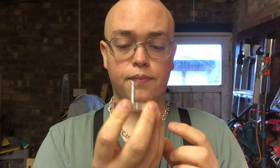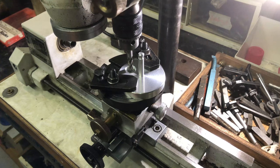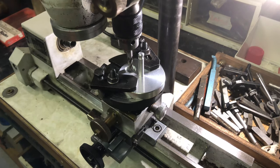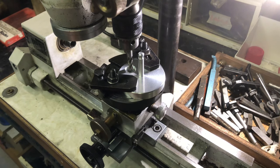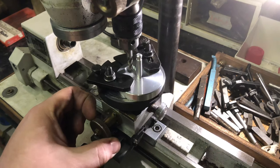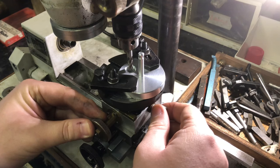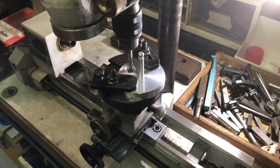So, what I'm going to do, I'm going to get the mill all set up for you guys and get this on there, and then I'll bring you back once I start the milling operation. Right guys, I've got it set up on the rotary table now, nicely clamped down, these are all nice and solid. The mill's all set, centred on the hole. The cross slide is locked, it can't go, as is the saddle, so it can't go nowhere. The only thing that can turn if I loosen this off is the actual rotary table itself. Let's plug the mill in — it tends to run better if it's actually got power. Let's make sure it spins, which she does.